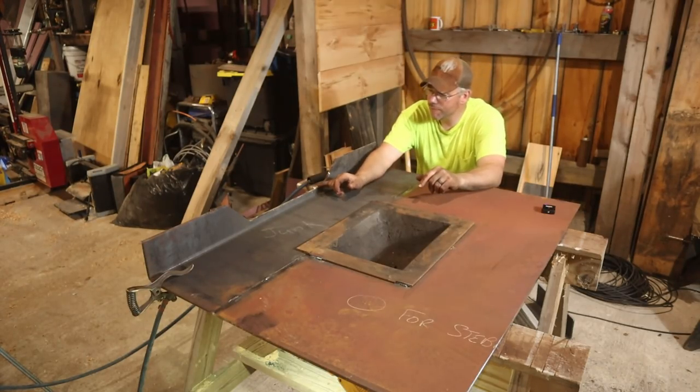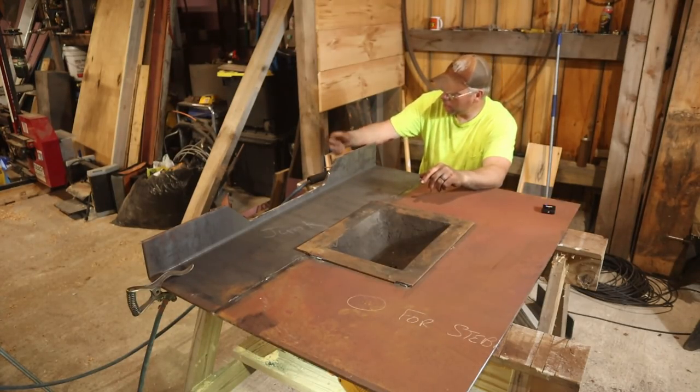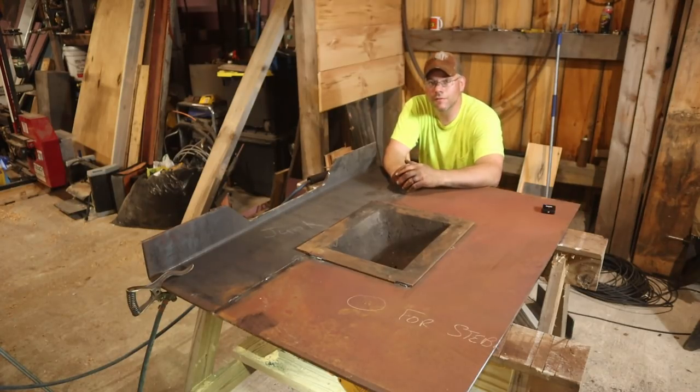Now this right here, I'll have to go through with the flap disc and soften all these edges, everything up top. And actually, I cut my arm loading this the other day. So we gotta soften all the edges. We don't really need to be reaching into the forge for something and, you know, ending up getting cut doing it.